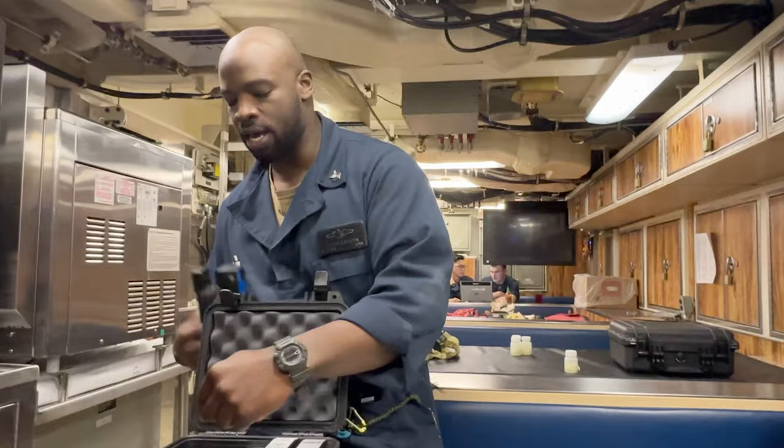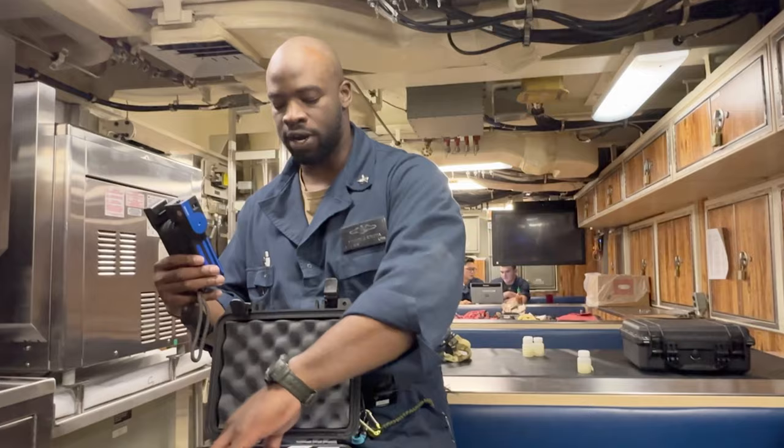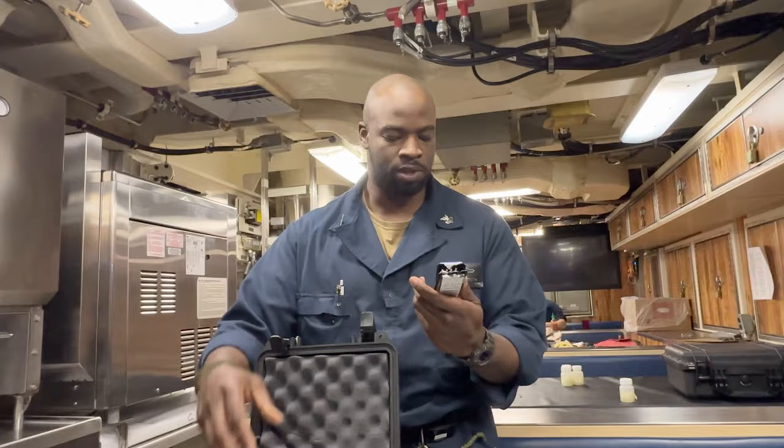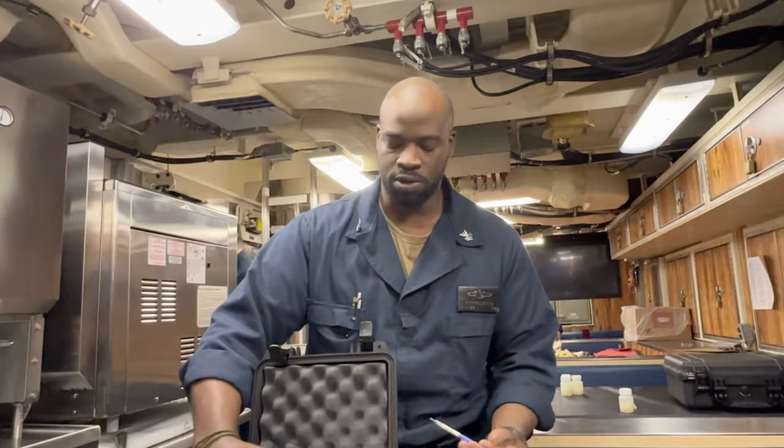Oxygen is something that we want to see, but there are plenty of harmful gases that we don't want to see in the air, and that's what this next device is for. We have what's known as our Draeger tubes, which is a way for us to track atmospheric contaminants. So, for example, this one tracks hydrochloric acid.